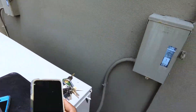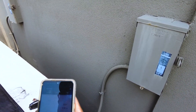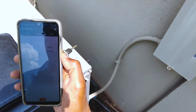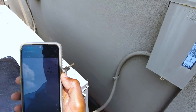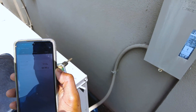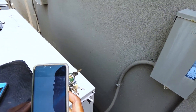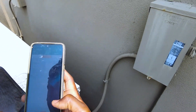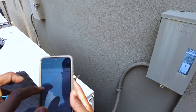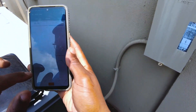Alright, I'm going to start it back up. What I'm going to do is check my amp draw. Compressor amps is 10.8, about 60 Hz average, 11 amps. Let's just let it run. I was going to graph out and show my frequency and amp draw. The green is going to be the amp — the current.